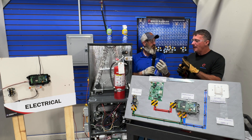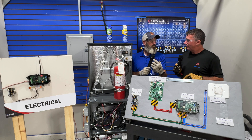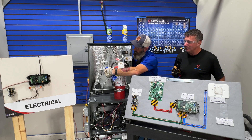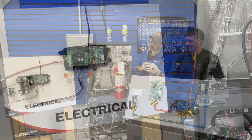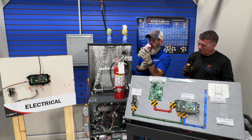So let's see — remember, 134a is an A1, not an A2L refrigerant. But I have a theory that we're actually testing for fluorinated chemicals, so let's see if we're going to set off our refrigerant leak detector with 134a, an A1-classified chemical. And there we have it — and within 30 seconds we start the blower motor.